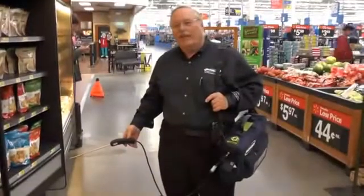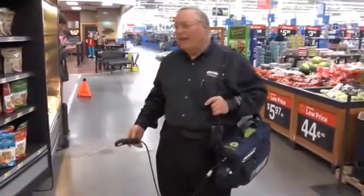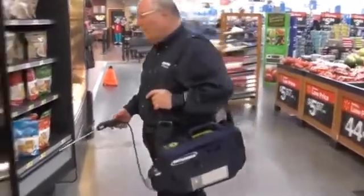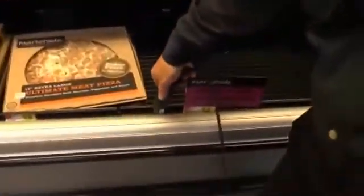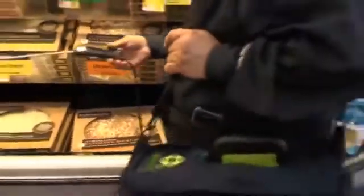One of the processes for leak checking would be checking the open front cases. The best way I've found to do that is what I call the drop and stroll method. Here's an example of the open front cases. What I'll do is stick the probe down inside the case — it takes about five seconds for the information to get to the leak detector — then I'll walk down and probe again.